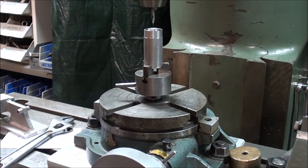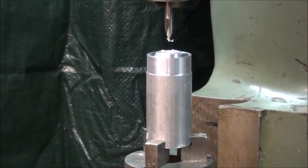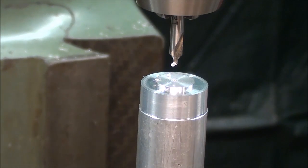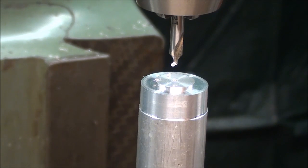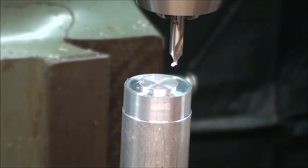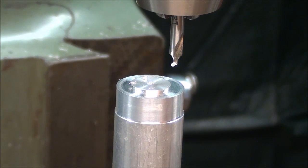Not that I want a hole in the center, but you can see that it is right in the center. The hole center is 380 thousandths from the center out, so looking at my readout — and that can be done with the dials also — I'm dialing in 380 thousandths right there, and locking the table.